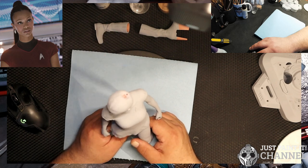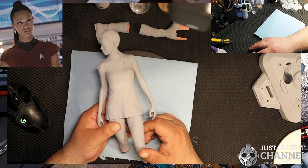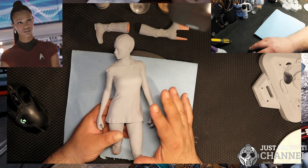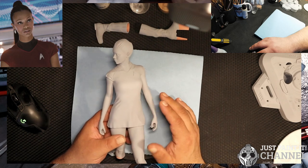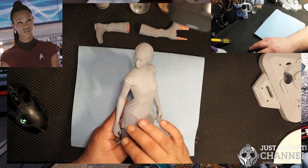Best thing to do is use a good fill primer. I use Krylon automotive primer, and it works fantastic. You get a nice coverage and nice finish, and you can sand it. But before you sand it, you let it dry really good overnight.